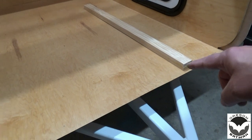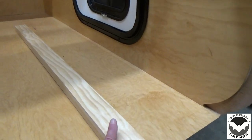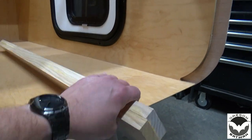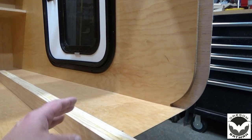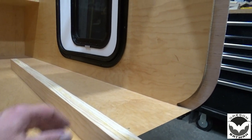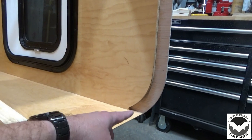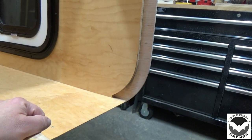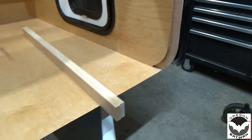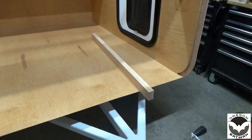Now we're going to get ready and install our spar here across the front. I had an eight-foot piece of one by four by three-quarter inch, cut that in half, stacked it and glued it, and that is going to be our piece running across the front. The first thing I need to do is true up one edge, then cut it to length, set it in place and mark it for our angle. Once that's done, we can cut the front for this angle. Then we're ready to pull out the wood to bend around for our ceiling, so let's get this piece cut and fit and then we'll do a little bit of unboxing.